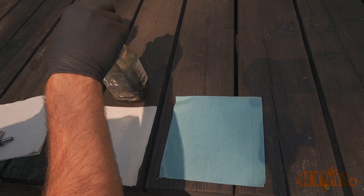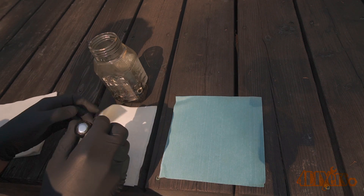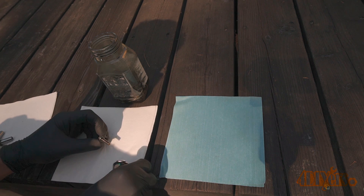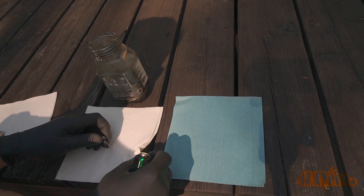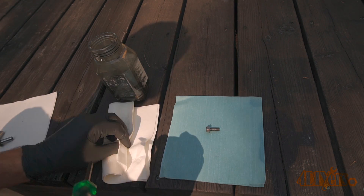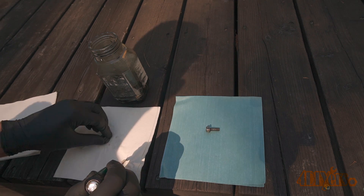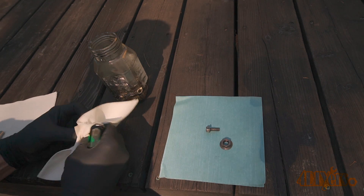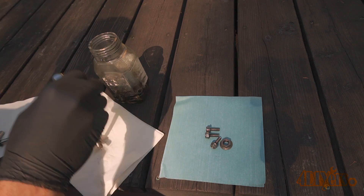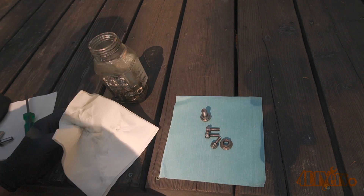After those fasteners have been soaking in the solvent, this will remove any contaminants, grease, or even just oil from your skin. Rubber gloves are a must so the fasteners don't become contaminated — otherwise it will leave imperfections in the surface finish. Pliers can be used, but the jar opening wasn't large enough so I magnetized a clean screwdriver instead to pull out the parts. Each part is wiped down and left on paper towel to have any remaining solvent evaporate.